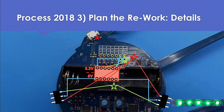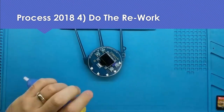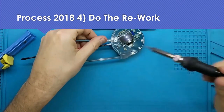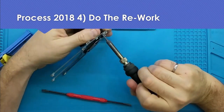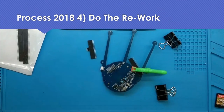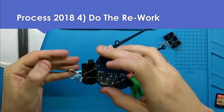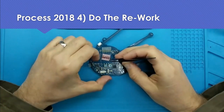Here's a little sped-up video. We're going to take off that battery connector first — apply heat and pry it off. You don't need to keep the battery connector; if you don't want it, you could just cut it out with side cutters, which can be a lot easier than prying with heat. Then we're going to glue on those headers — putting them into socket headers so they stay aligned, then clamping and super-gluing them.